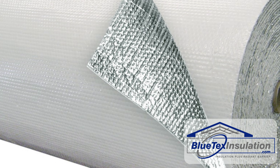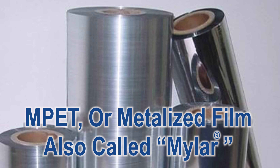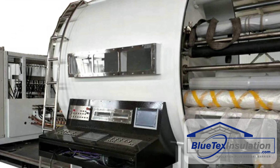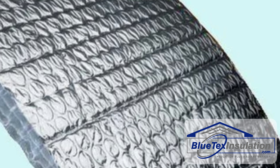Let's get into the actual process of how bubble foil is made to fully understand why it's destined to fail. Most bubble foil products are made using a product called metalized film, or MPET. One of the brand names for this product is Mylar, and you see it everywhere because it's a commodity product and it's cheap to make. Many packaging products use metalized film. Basically, it's a potato chip bag or those shiny metal-looking balloons — a piece of clear polyester film with a layer of vapor-applied aluminum on one side. This is done in a giant vacuum chamber where the aluminum is vaporized and a super thin layer sticks to the clear film. Then the film is put on a vacuum roller with little pockets to create the bubbles and sealed with a white layer of plastic film.